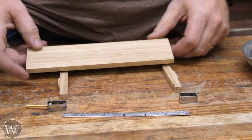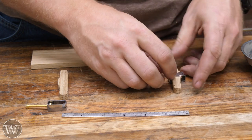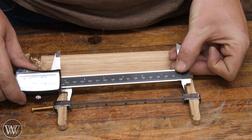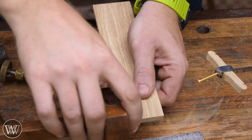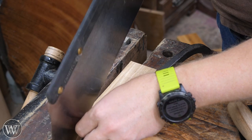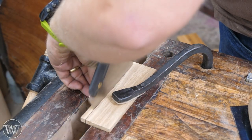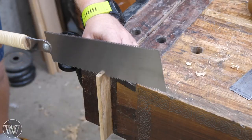After that we have the basic shape — more carving to come. Now I need to make the two beams that go between these, but first I need to figure out how long they need to be. I put calipers on and measured, then made them a little longer to allow for the tenons on either end. Yes, we're putting tenons on these and mortises into the two end pieces. When working with small pieces, clamp it in the bench so it's not bouncing around — goes pretty well, or you can clamp it off the side. I really like doing this with Japanese saws.